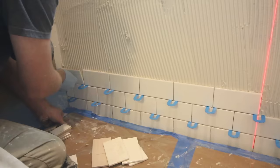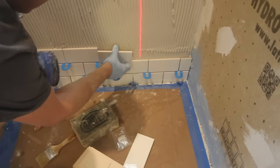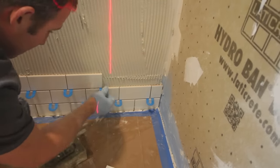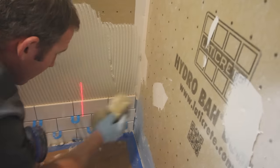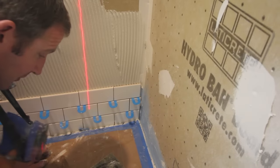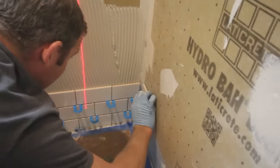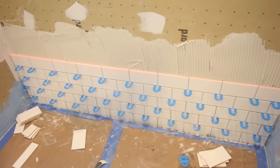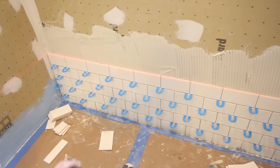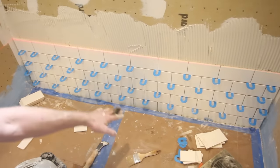This is our methodology, and we did this the entire way up the wall until we met with the window in this shower. Unfortunately, the window could not be removed, so we had to work around that. We'll give you some tips on how we did the planning. We're just making sure that our grout joint is still there between this row of tile and our plumbing wall — you need to have that expansion contraction joint. We set our laser level on the top course as we went up the wall to make sure that it continued to stay level.